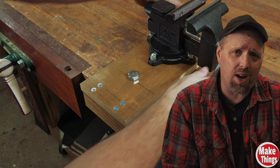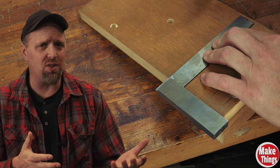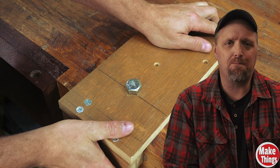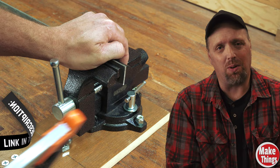To create this, you're going to use the same jig setup as before, except we'll move the second cross piece so that it sits at the end of the jig. After transferring the bottom edge of the hole, move the line in slightly so that it pinches the jig to the table, then drill the hole with a 5/8" bit. When it's time to use this, it pulls the jig tight between the surface and the hole. To remove it, you can either hit the bolt from the bottom or use a flathead screwdriver to free it. Like the last option, you'll find this build on my second channel — both will be in the description below.